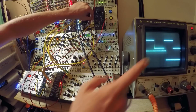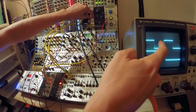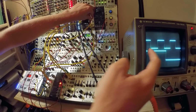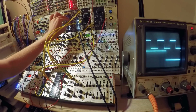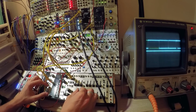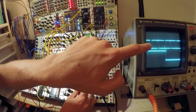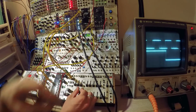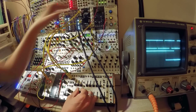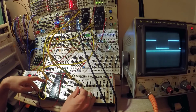Right, so literally, do you see on my scope? This is the original, and that's the divided by 2. If I use thirds, look, it's literally divided by, multiplied by 3. You divide by 3, you multiply by 3. As you adjust the frequency, you get a whoa. Look at it, trying to track, doing so slowly. It gets there. You got it. So, basically, if you've got a divider, you've got yourself a very neat way of creating frequency multiplications.